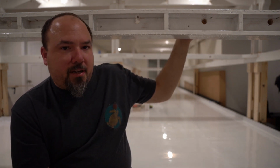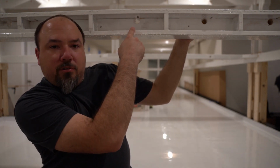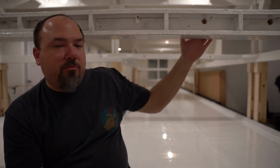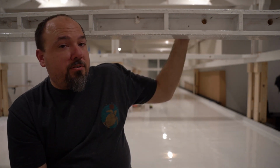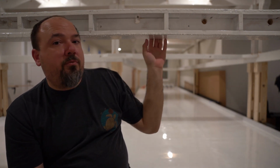Once all that patching was done and I was satisfied the fiberglass was good, I drilled out the holes that I needed for cross braces. I did not drill the ones I did not need. Then all sides of the beam where it was fiberglass were sanded down with 40 grit sandpaper. This is just to rough the surface up for Pond Shield epoxy. Give the beams a good cleaning and a dust off, and they were good to go.